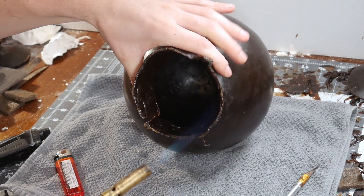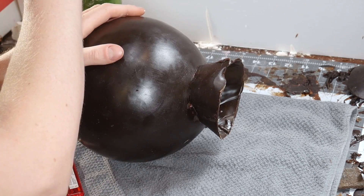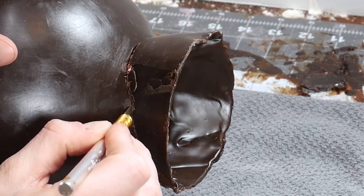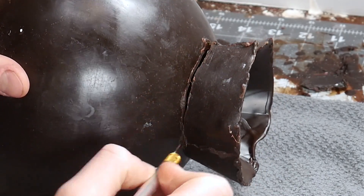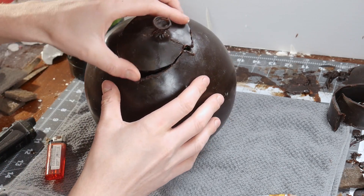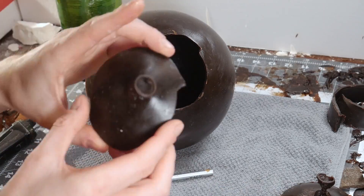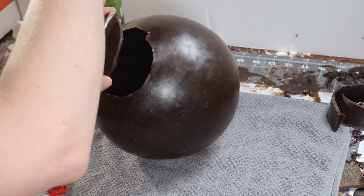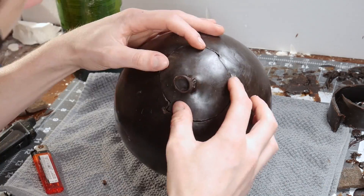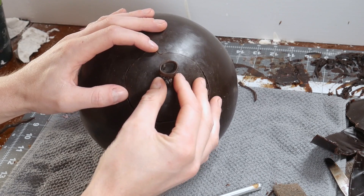Because I isolated the balloon knot in its own separate piece, I have a little bit of work to do at the hole where the balloon knot section gets added back. I start by removing this excess pour spout flange piece to make room to fit the balloon knot section back into. I want to keep it pretty tidy so I carefully cut along the flange line — the better job I do now, the easier these pieces will go back together when they're in bronze. For the initial fit it's not quite right, so from here it's sort of guess and check: cut a little, test, cut some more, check again until I get the tight fit I want. Finally I get the fit I want and it's about ready to be sprewed up.